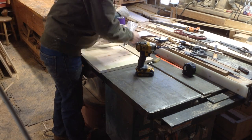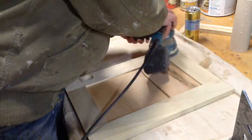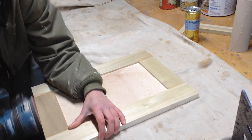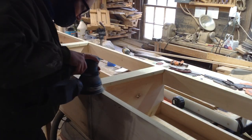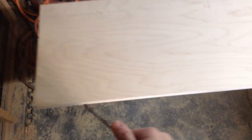Now this was the decision I was waiting on the customer for because I originally broke the whole piece up so that it was the same distance, but then the lights weren't centered over the bookcases and it could look a little weird. So while I was waiting for him to reply, I went through and I started sanding all the panels for the doors and everything. I sanded all of this to 80 grit. I like to sand in between coats of paint. So I don't get crazy with this — I sand 80 grit, remove all the glue residue on everything. And then it's ready for primer. Take all the hardware off, all of that.